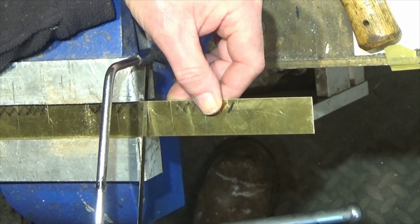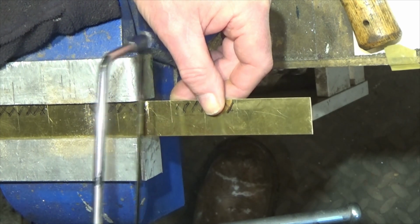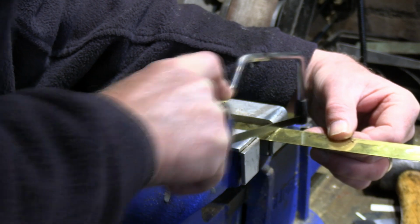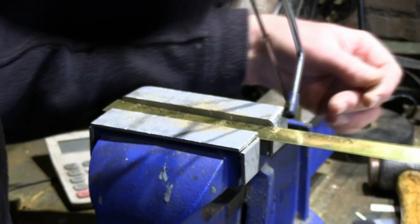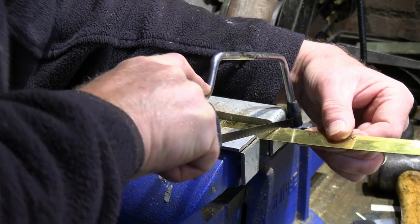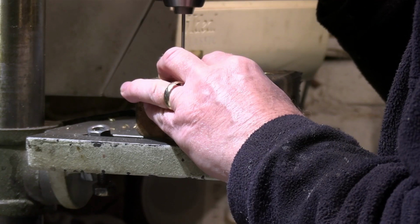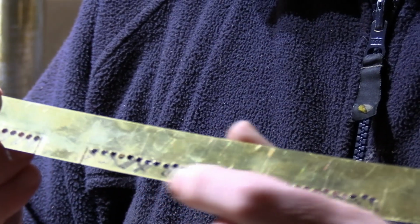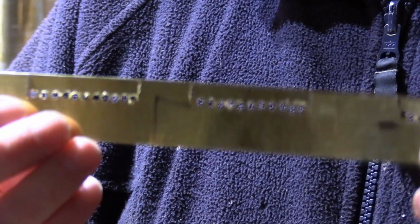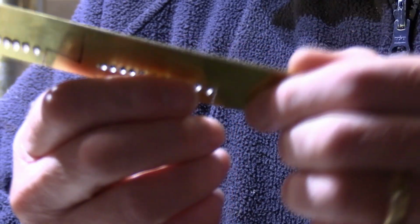on cutting this out. So I've got this in a horizontal position, so the saw teeth have a little bit more to grip on. If I were cutting it that way, it would make a right mess of this because it's quite thin. Just done some chain drilling along here, and the idea now is I should be able to break these out.